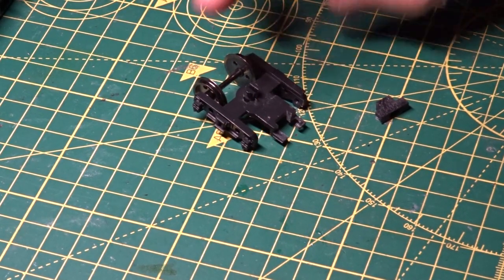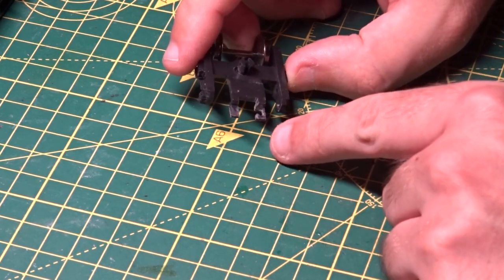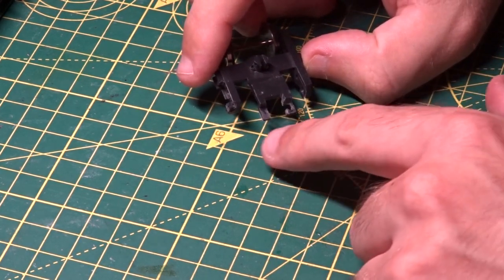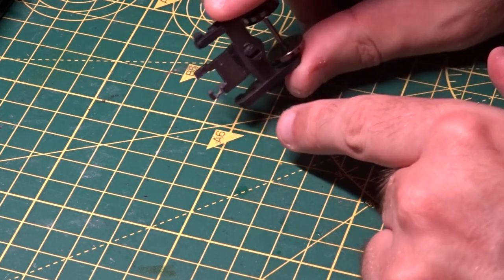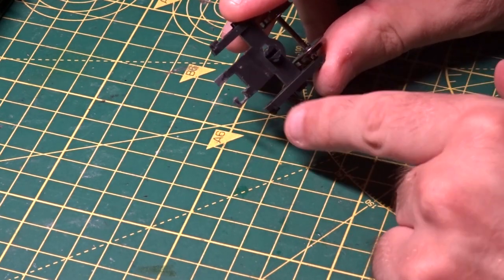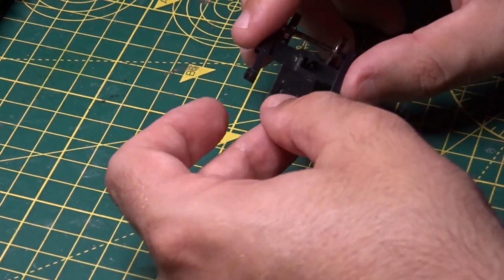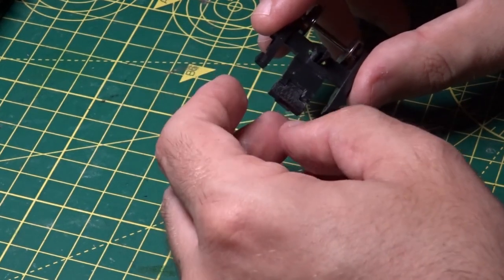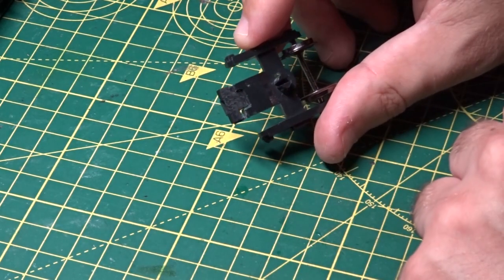Okay, so you join me back. You can see I've managed to survive the cutting disc on the left, or your right, or my right hand side. So that bit's still attached, that's fine. As you can see, I've cut the channel down the middle and into the top of the bogie itself. That's a millimeter and a bit, maybe two. And as you can see, just do a small trial fit with the pocket. That fits in there quite nicely. Still needs a little bit of filing on this side, but overall it looks pretty good.